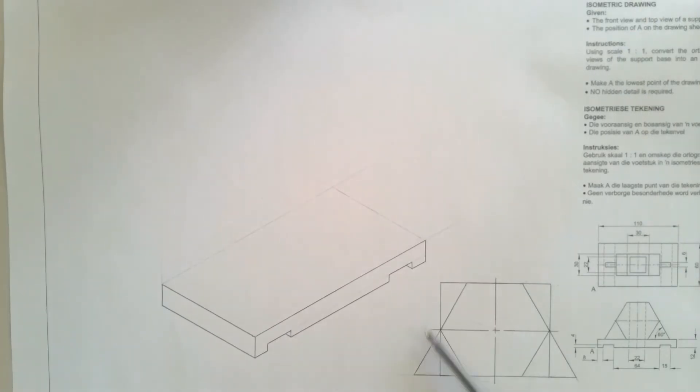From my auxiliary view, I've drawn the full hexagon and the rectangle that goes around it. I've also added in these two extended sides here, and if you look, you'll see that's exactly the same as what we've got in our drawing. I know those are at a 60 degree angle because I used my 60 degree set square and it lines up with the side of my hexagon. I'm going to use the measurements from that to go and draw in this view.